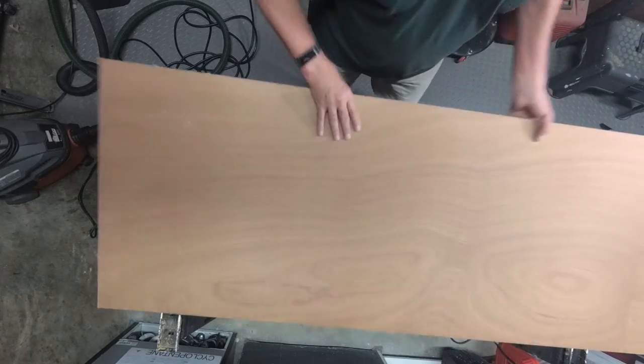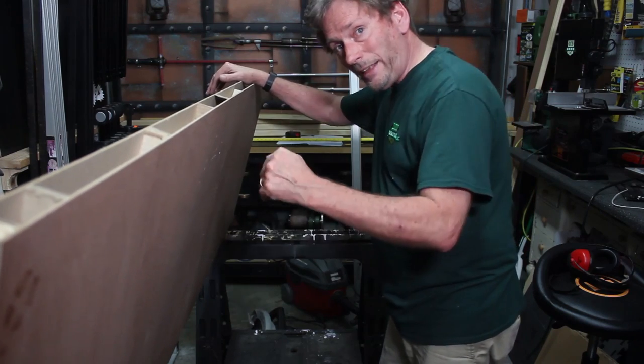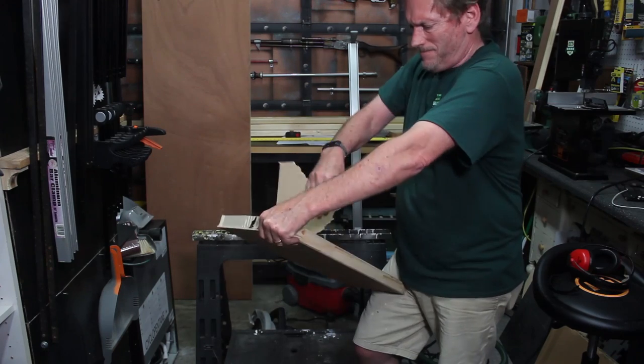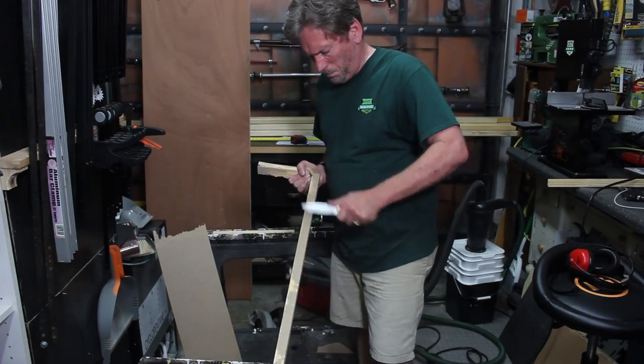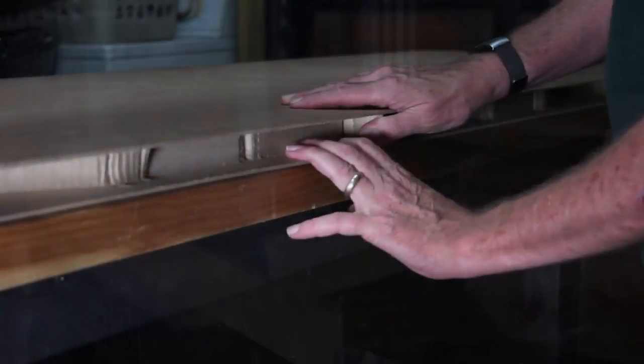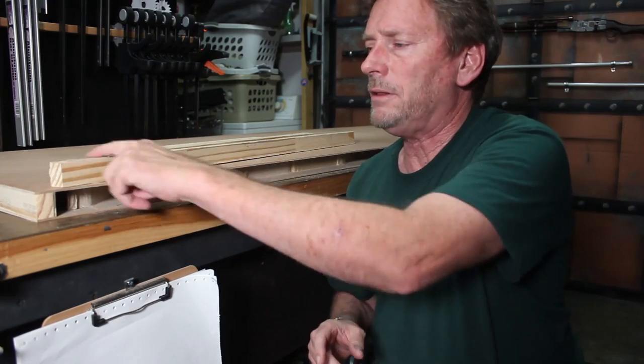I've cut from both sections. Let me tear the part I just cut and slide that into place. Now that I've cleaned out all the cardboard, pushed that back, and trimmed off the wood, I think we're ready to start gluing it into place. You want to avoid getting any glue on the surface as much as possible because that's just going to be more that has to be sanded off so that your stain will accept.